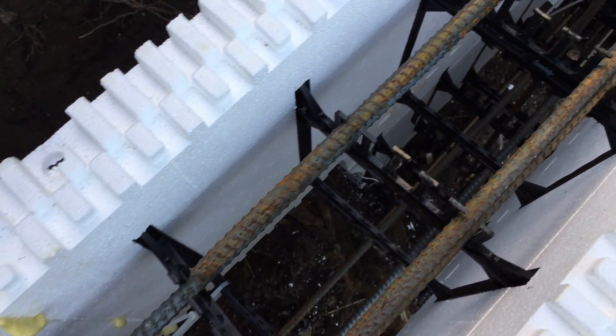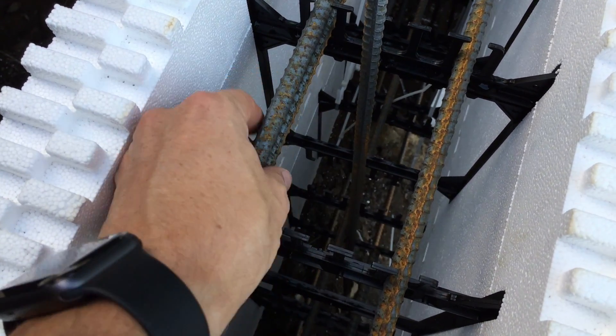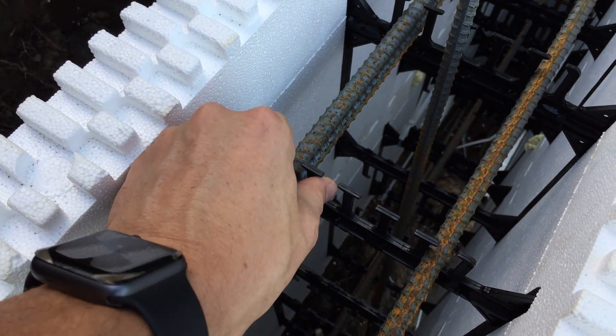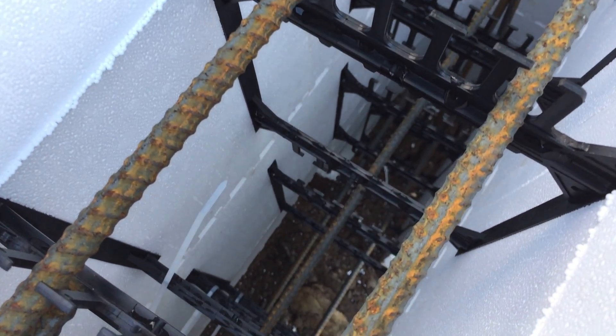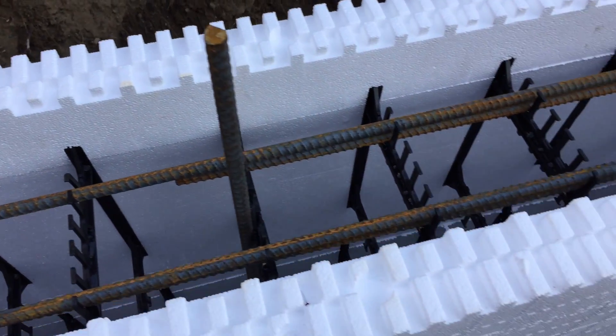That's really going to make this foundation rock solid. I've got two pieces of steel up top where it overlaps coming out of the foundation. When using ICFs like this, you don't have to tie these — they're in a pocket which holds them together. I've got steel on the top row, then I skipped a row, and there's steel down below as well. Around the corner there are two pieces of steel, and then coming around the side there's more overlapping steel and another vertical piece.